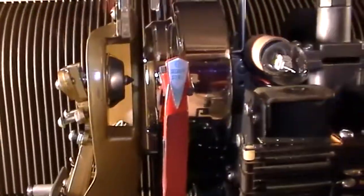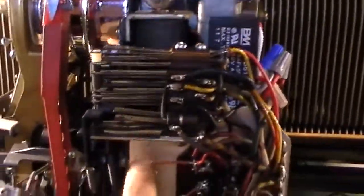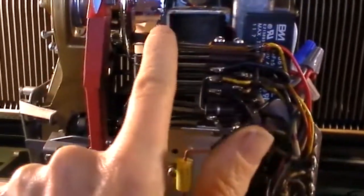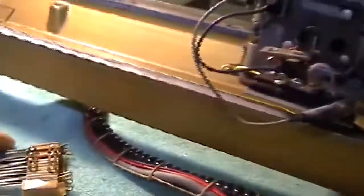It turns out that side is required to make it play 33 rpm records. A modification had to be done to what's called the cam switch — I needed another contact on here for the 24 volts to activate this power relay over here that makes this thing change between 33 and 45 rpm.